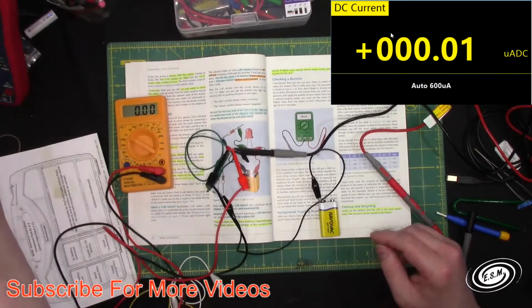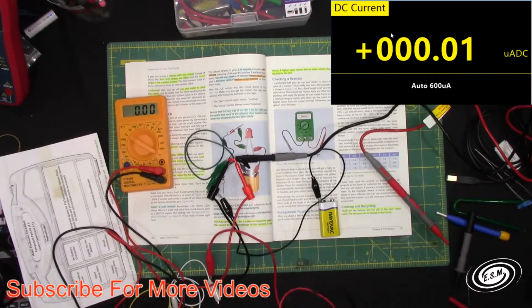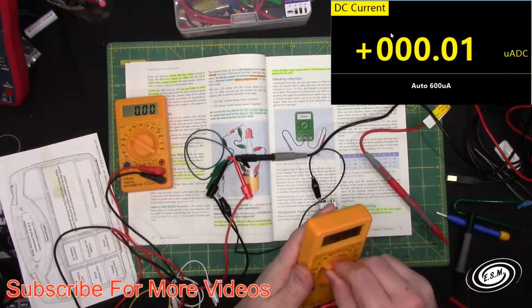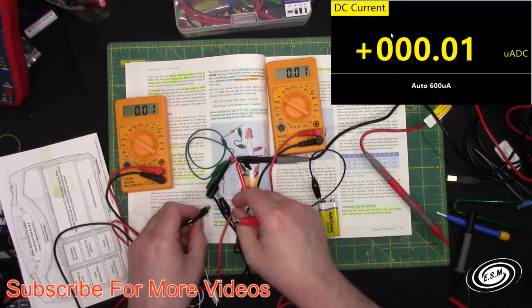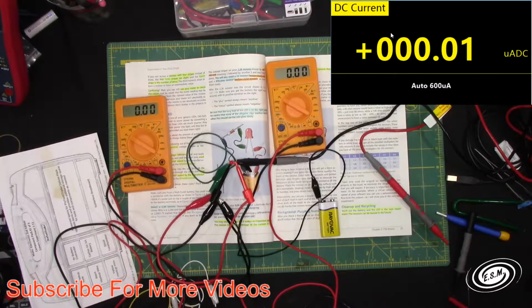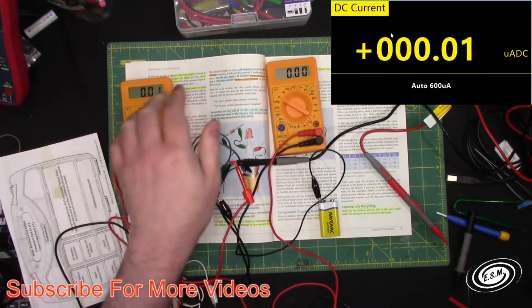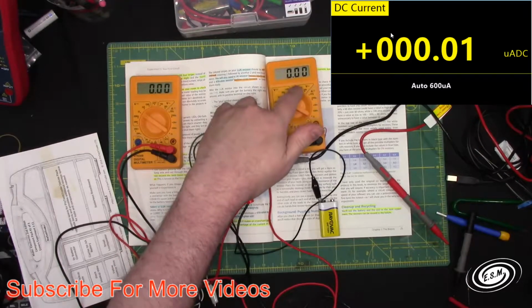And then now I'm going to grab my other cheapy meter, because they have the alligator clips on it. And an alarm is about to go off, and I'm sorry about that. So we're going to do 20 volts on that one, and we're going to put this across this resistor. And hope all these are connected correctly. Okay, so I have current being measured in the top corner of the screen. I have the voltage across the diode here, voltage across the resistor here.